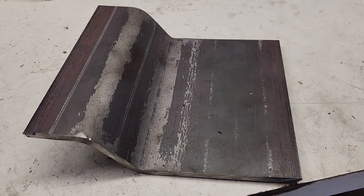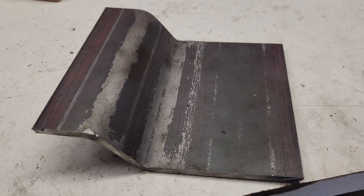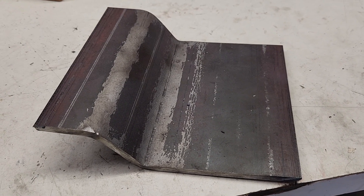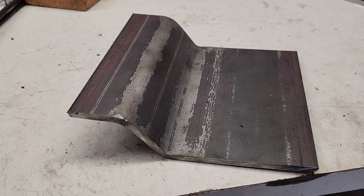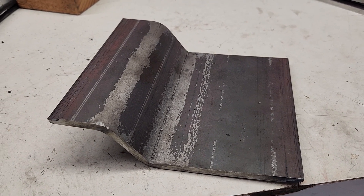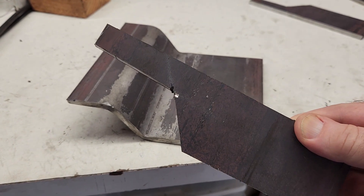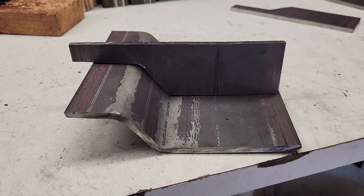For this project I got a piece of 8 inch wide, quarter inch thick flat plate and cut it into six and a half inch strips. This is what mounts to the actual locations on the pickup. For the Ford F-150 there are already really heavy-duty mounts for running boards and stuff rated for 6,000 pounds a piece - three mounts per side - so it should be just fine. I had it bent by my friend Kurt, then from there I mount the pipe that goes over to the main sliders connecting them to the truck. There's also an extra strength gusset down the back of it - another piece, about two and three quarter inches wide of that same quarter inch thick material - welded on as a backbone to it.